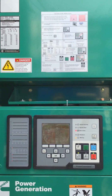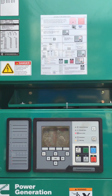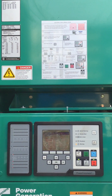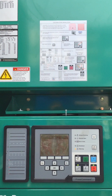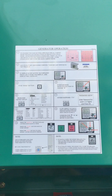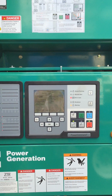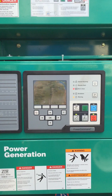This video will show how to change a Cummins 500 from 480 to 208. We have already changed the link board from 480 to 240 to 208 mode — that's already been done on the other side of the machine. There is an explanatory instructional sheet, a decal, located just above the control. Now our technician will show how to adjust the control from 480 to 208.